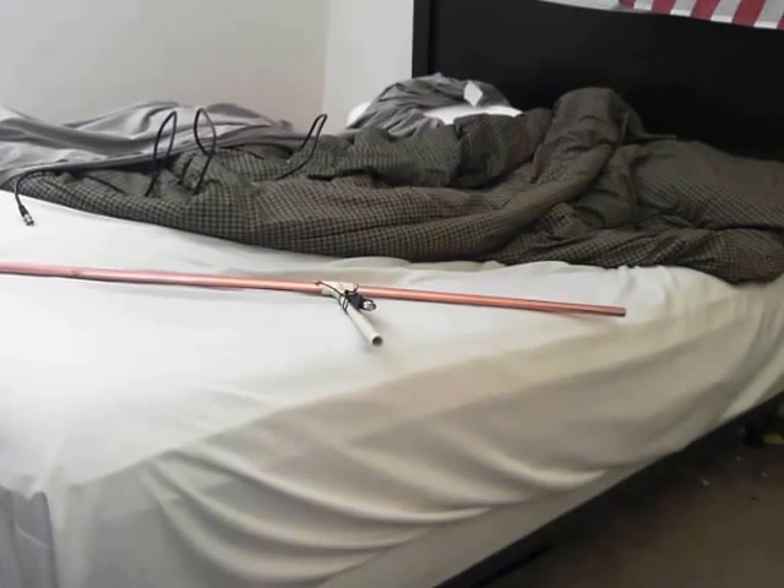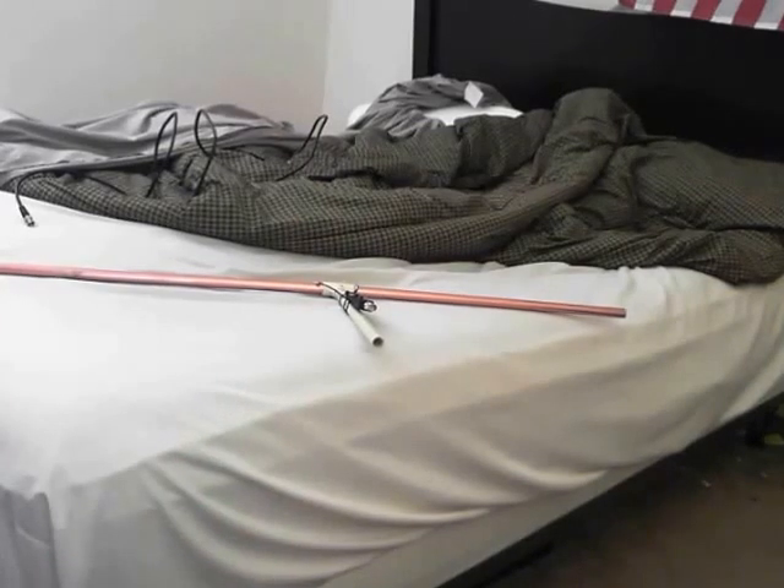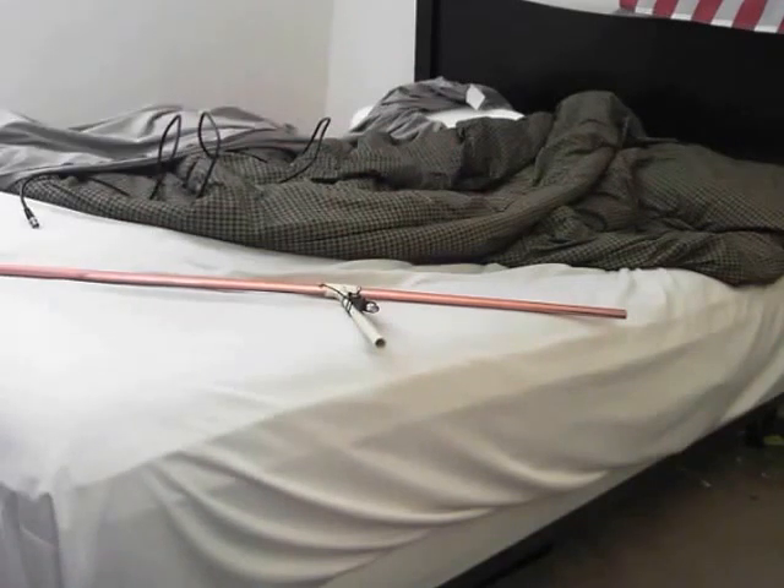The experience alone is definitely worth it if you've never done it. Tool-wise, you're going to need a pipe cutter that can cut both PVC or PEX pipe — which is what I used — and copper pipe as well. Preferably the kind you spin around the pipe and keep tightening. You'll also need a drill and a one-eighth inch drill bit, a Sharpie, and a tape measure. The Sharpie is to mark the points for cutting and drilling.